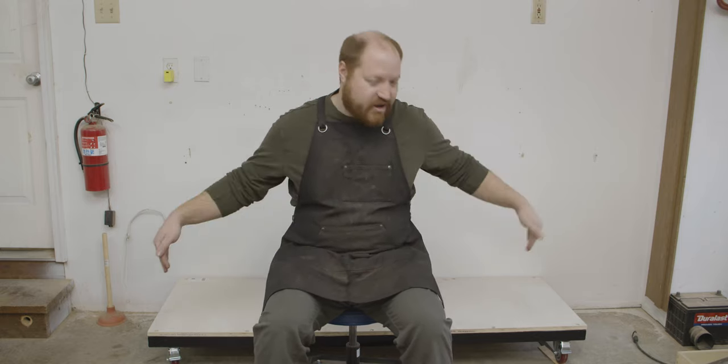We're gonna start with the two base cabinets that are 72 inches wide by 24 inches deep. We're going to glue those together and screw them together and make them one. And that's gonna start with a little bit of sanding to remove the clear coat that I put on the cabinets when I first built them so that the glue has something good to bite with. Once I get those glued and screwed together, we'll put them on the base, properly attach them, and then work our way up with the rest of the cabinet shells. So let's get started with that.